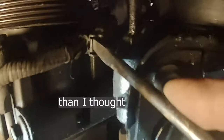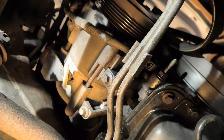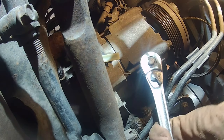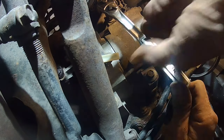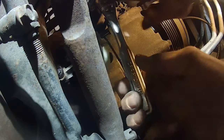The wire is tight against the compressor — just push in, use a screwdriver to pull back and it's unplugged. On this AC compressor there are three bolts holding it on: two on the bottom and one up on the top. These are also 10 millimeter head bolts. I'm going to initially break them all free — they're fairly snug. This seems to be the story of everything on this whole project, and it don't get better as you go along.